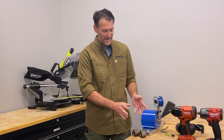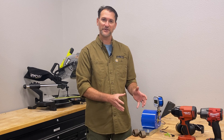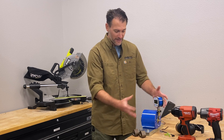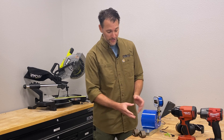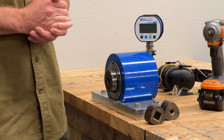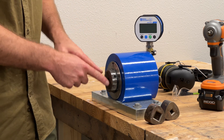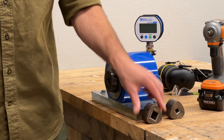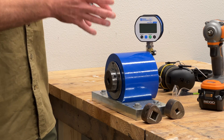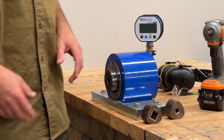So what does it do exactly? Instead of using a bolt-based system for testing impact torque, it's all housed in here. There are a couple of pistons that use hydraulics and shoot up to your gauge to figure out how much torque your impact tool is actually delivering. You're going straight into a drive adapter — there are three drive adapters available: half inch, three-eighths inch, and three-quarter inch. It doesn't go all the way up to one inch because of the 1,000 foot-pound torque limitation on this thing.